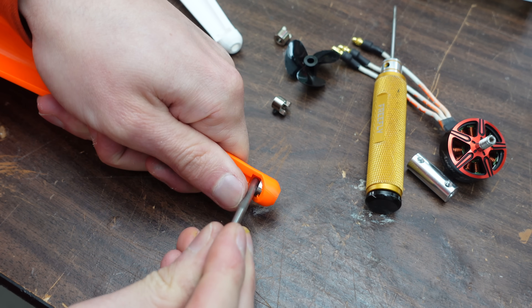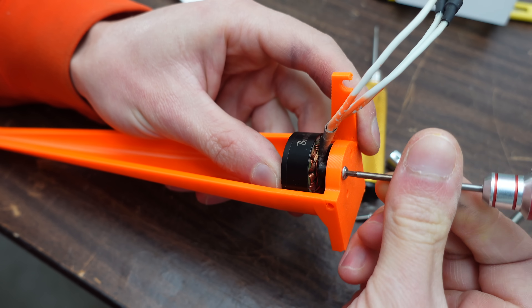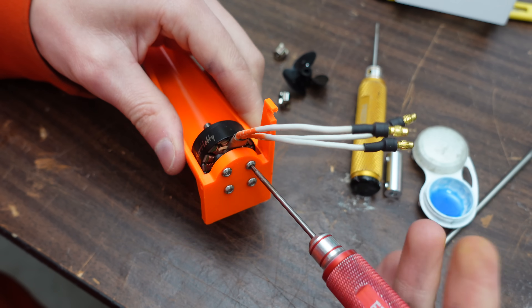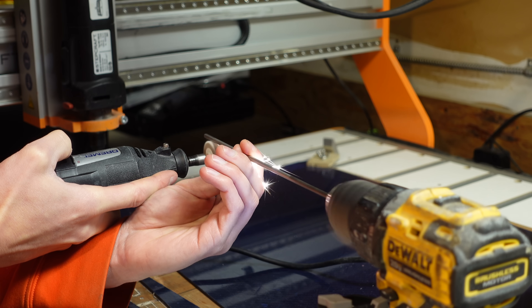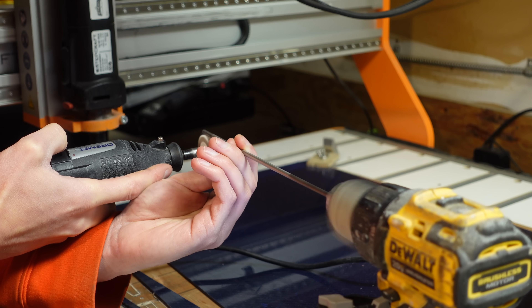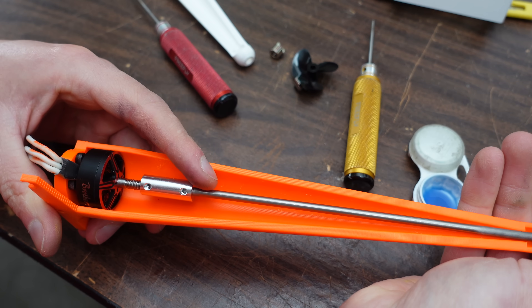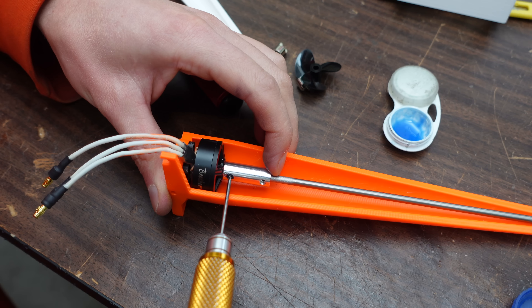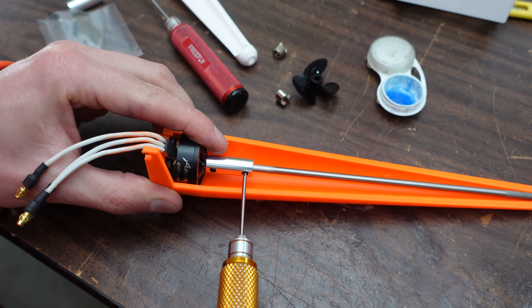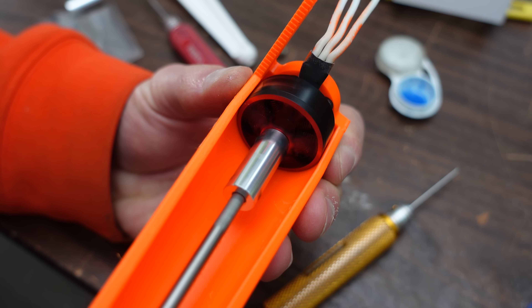After that it was time to make it. I pressed some bearings into this 3D printed long tail housing and then screwed the motor onto the back. This thing is an aircraft, so it needs to be decently lightweight, and for that reason I'm using titanium for the motor shafts. The stuff I bought was slightly too large to fit on my bearings, so I plopped it into my lathe and ground down the outer diameter a little until it fit. That worked pretty well and then it could slide right into the bearing and the coupler I used to attach it to the motor shaft. This is just a 2507 FPV quad motor, and the propeller just attaches to the end with some little locking collars.